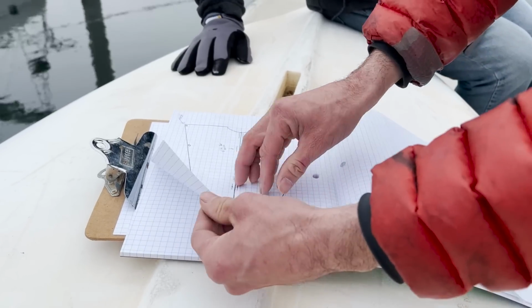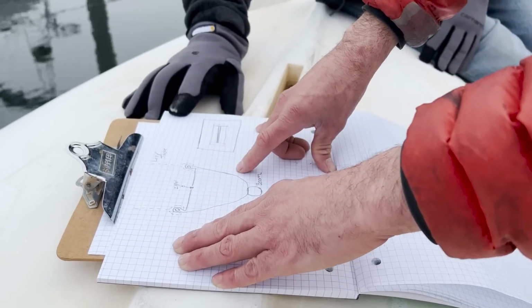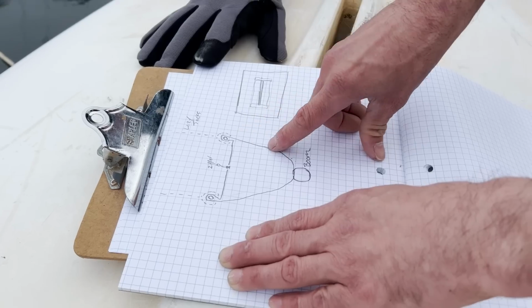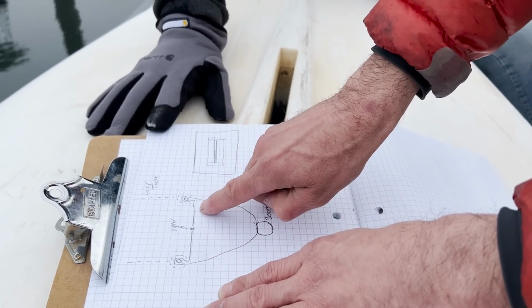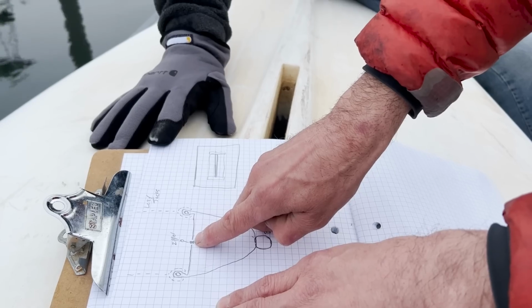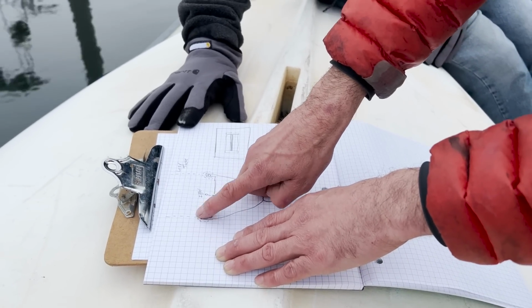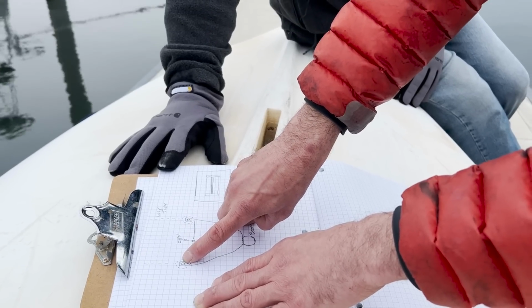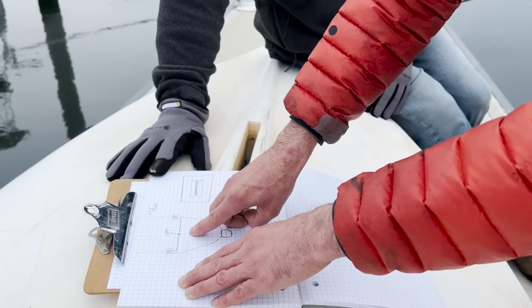And then since this isn't straight lines, it's the worst drawing of them all. But this is an idea, and if you were to look at it on end, you'd have your boom, forms a U of fabric. The sail's gonna stack all in here. There's a flap on the top with a zipper. And these are where the lazy jacks are gonna attach and pull up. And we're gonna put a thin piece of tubing in there so that there's some rigidity to the stack packs.